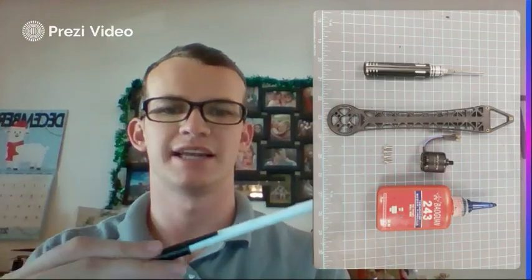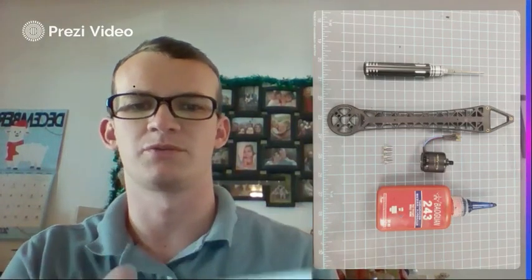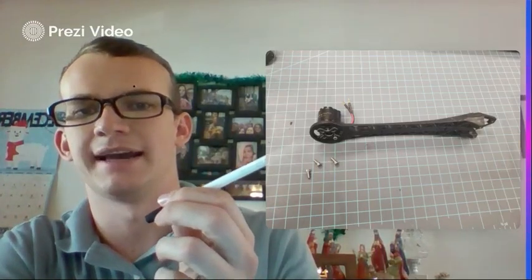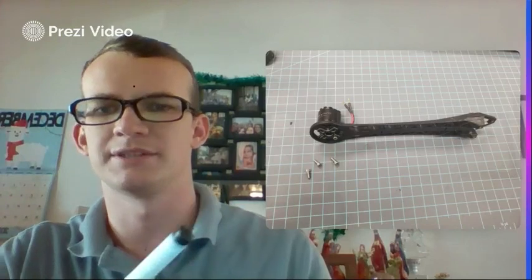Right now we're going to start with attaching the motors to the motor arms, using all the pieces there. So yeah, there is one piece I am missing in this example picture. You'll see in the next one, there's going to be that pad similar to a washer for the motor mount and the screws. Slide it in here. Underneath, you see we're going to get that right below where the motor is going to be attached, where that first screw is. We're actually going to be using that motor mount plate, and it's that black cross looking piece. So you're also going to need all 4 of those for this part of the build, along with 4 screws for each motor mount. Those are going to be your M3 by 8s.